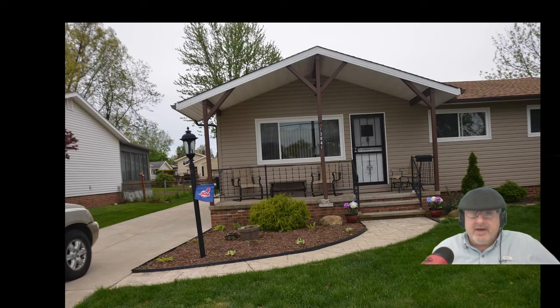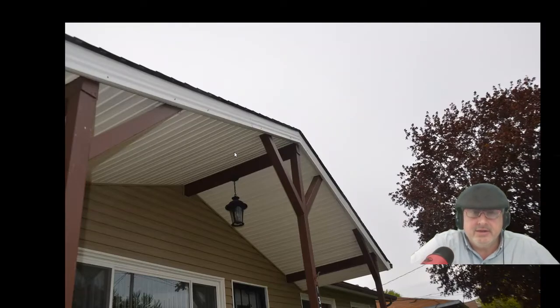You've got columns on the outside. Here you can see three columns. You want to make sure that the structure isn't cracked — it was cracked and they fixed it, it had settled. You want to make sure the supports are good. Always look at them because they're going to hold up a lot of snow loads and dead loads.